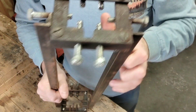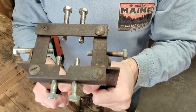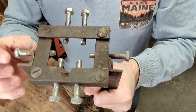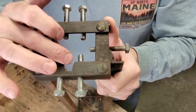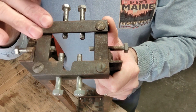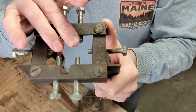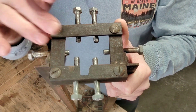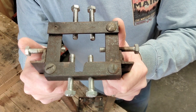The back of the jig looks like this — this is the notch for where it locks into the actual gun. Same thing: you want it to sit on the flat, which is why I have this notch here. This is flat all the way across, and it's going to be more accurate that way when it's sitting on the flat of the barrel.